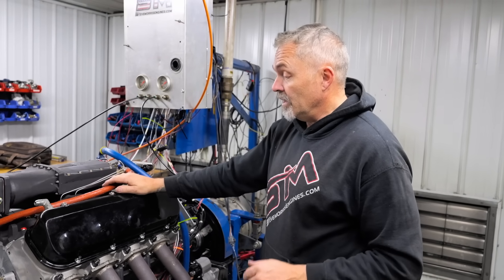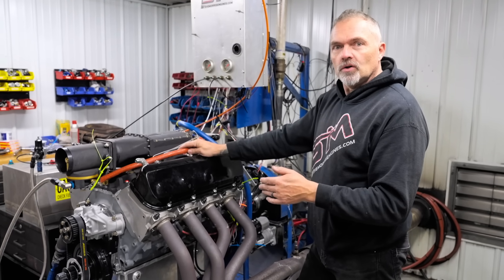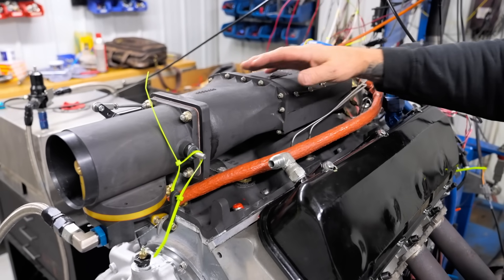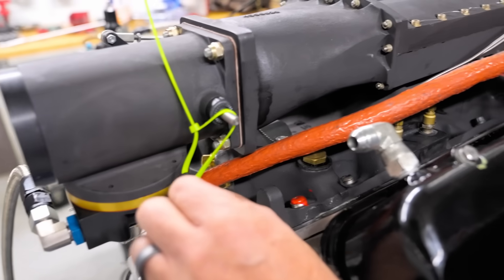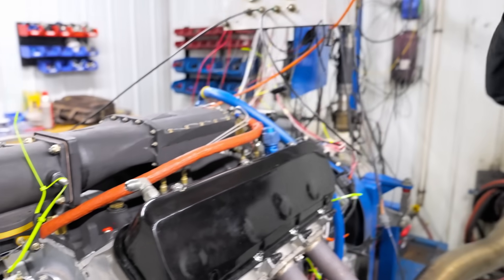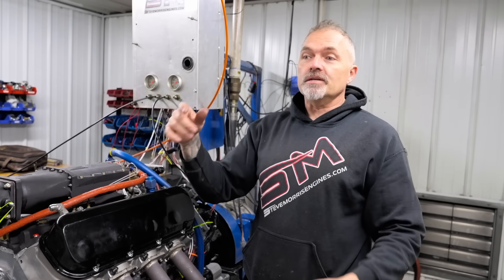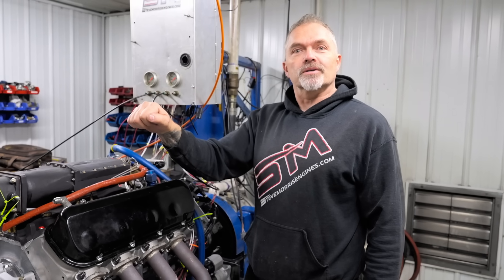This is a 540 cubic inch hydraulic roller with dual spark plug oval port cylinder heads, mechanical injection, and AV gas. The mechanical injection is interesting because this hand lean-out valve lets the pilot pull a manual lever to make the mixture leaner or richer while flying — adjusting by EGT readings or by sound, moving it richer or leaner until it sounds like a million bucks.